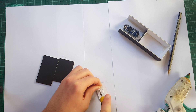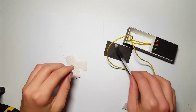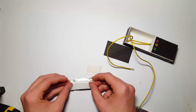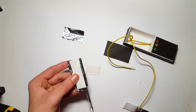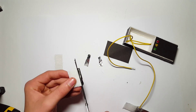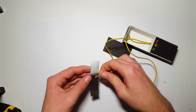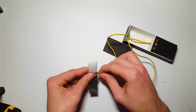Now that the case is nearly done, we can begin making the finger pads. To make the finger pads we'll need some velcro and some tin foil. The velcro has a sticky side on the back so we can stick the tin foil directly to it, then wrap it around our finger to make sure it fits. Take the wire from analog pin zero and tape it to the tin foil and hot glue it in place, making sure you make good contact. Cut a length of hook and loop that can fold around your finger about one and a half times, then cut the same length of tin foil and stick both pieces of velcro to it. Stick both pieces together, then glue the extended wire down making sure it still makes very good contact with the tin foil. Repeat that with the other extended wire and the project is nearly done.